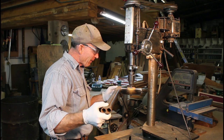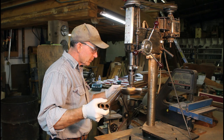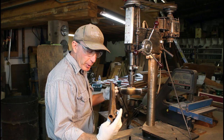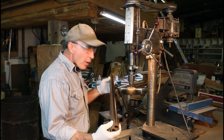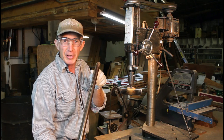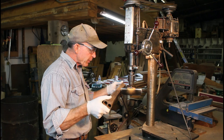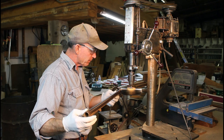Wow, that's showing up great! It does look like it's going to have to go through at least a couple of passes — there are enough spots of red rust that another pass may take those off. This is turning out kind of a brownish color, which I was expecting, because that's actually correct for this age of Damascus or twist steel shotguns — they would have had a brownish cast rather than the blue we see today, or black if you're talking about modern finishes.